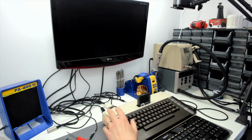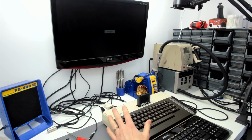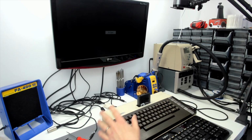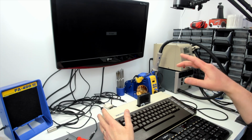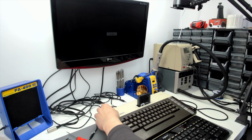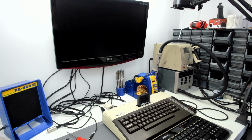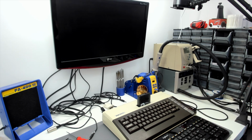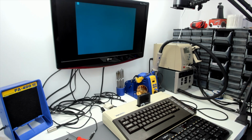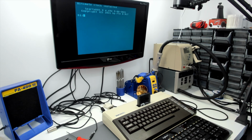Okay, so having removed the SRAM board and put the original RAM back in the machine again, I've left the machine overnight, so it's absolutely stone cold, and I've come back to it on Sunday just to be absolutely sure that we've got rid of this cartridge change detected error that I started to encounter, and we're going to test it now to see if we get that error again, because this was happening every time the machine was turned on after having been left off for a prolonged period of time. So this is in 20 megahertz mode, and it seems to have alleviated that problem.